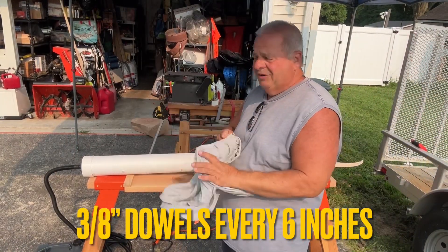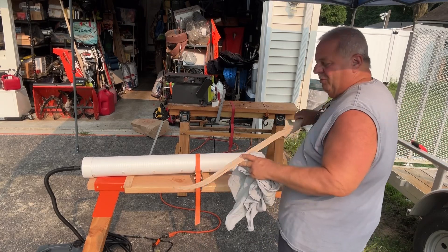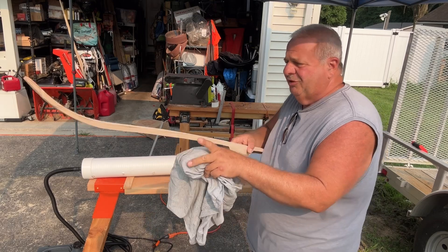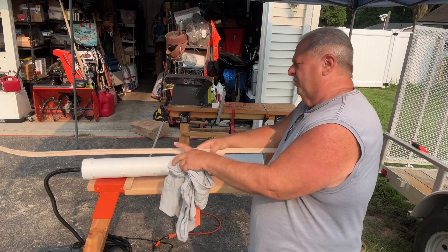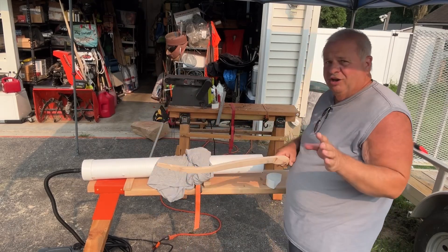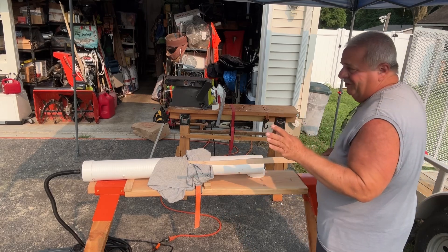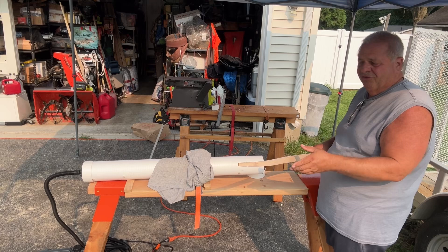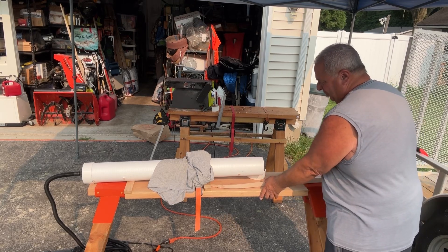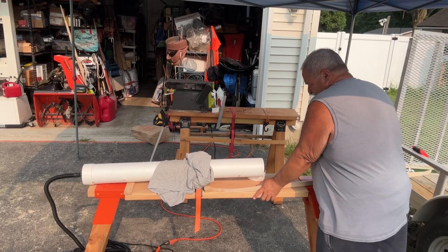Here's my simple little steam box — I got it hooked up. There are dowels I put through both sides. I have this board bow that when I tried to recurve it I had problems — I made narrow limbs but the limbs are twisted a little bit. The only way to correct this is to steam it. Before you steam something to bend, you've got to have your jig or clamp ready. And you've got to have gloves — stove gloves — because this is going to be red hot. I'm going to clamp this flush to the board and let it cool. That's the big plan.